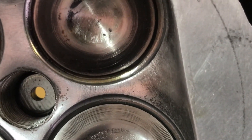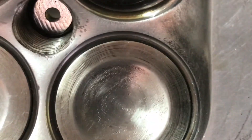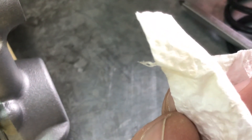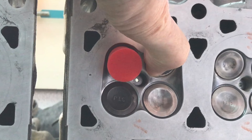I'm being very picky here, obviously. But with such a small capacity engine and such a small combustion chamber, these things matter. If you've got a 350 V8 with a large combustion chamber, these tiny leaks are probably not significant. But if you've got a 250cc four-cylinder with a combustion chamber of five cc's, everything counts and it becomes more important. Using a little piece of paper towel here — it does show up, the wetness is showing with a slight yellow tinge. Here's a picture of me doing the gasoline test on the lapped valve, holding it in with my thumb. I gave up waiting because it was obviously pointless.